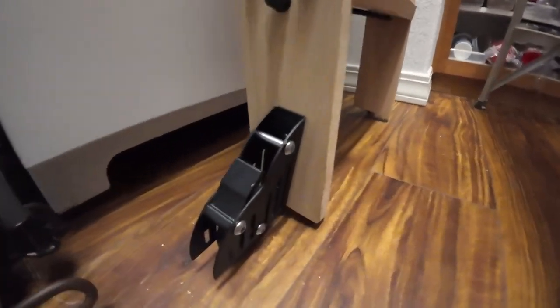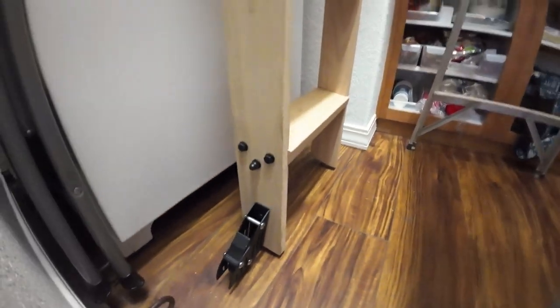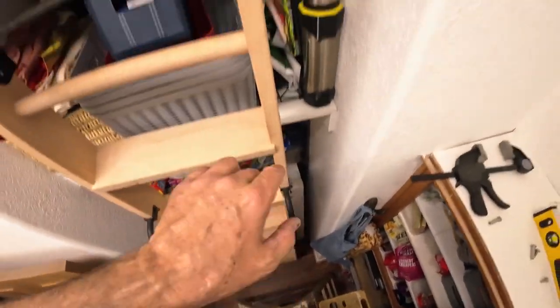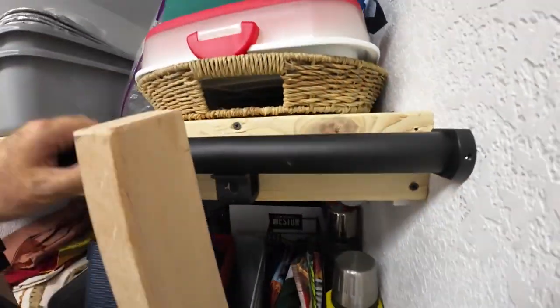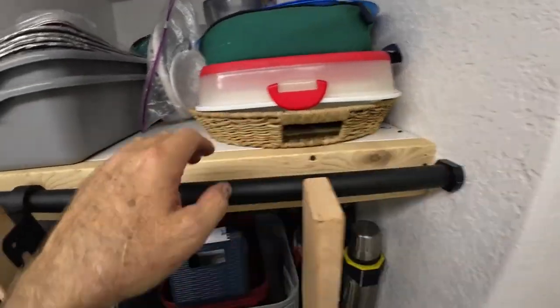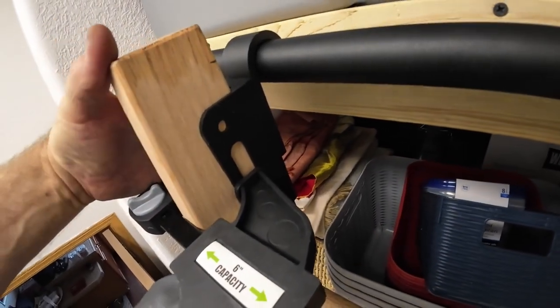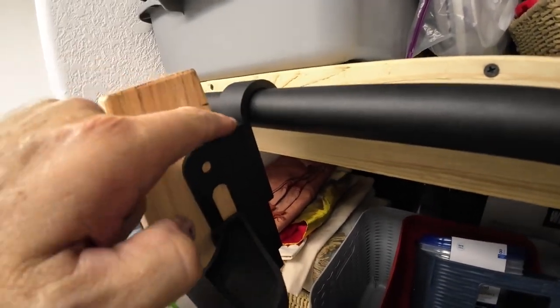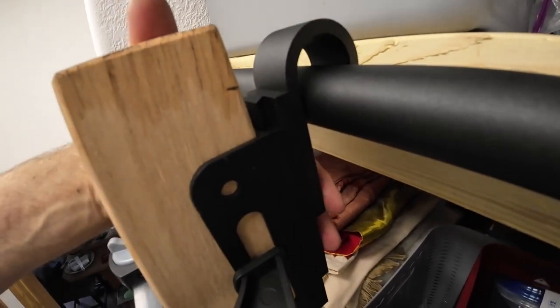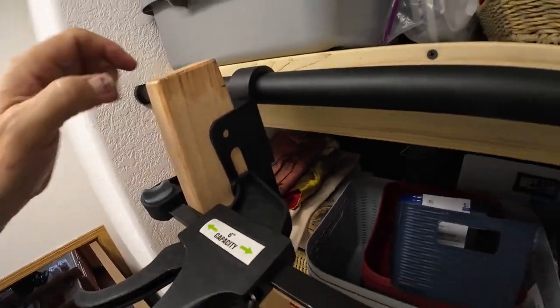Back in the pantry — we've got the wheels on. In the vertical position you can see the wheels are canted, which is expected. The rod is in and screws are installed. I put them a little higher so they don't split out near the bottom edge — they get a good bite in the wood. I've put my level on it and it's nice and level. I've clamped the hook bracket by dropping it down to touch the bar and making it flush across both bracket faces, then clamped it.